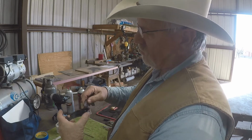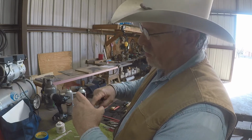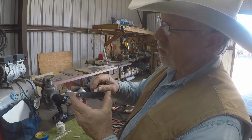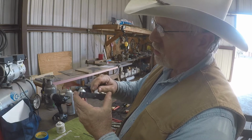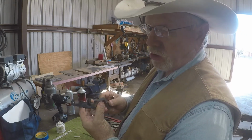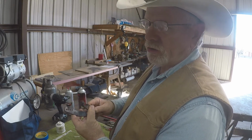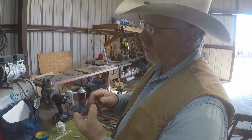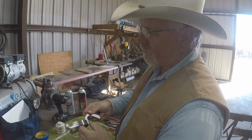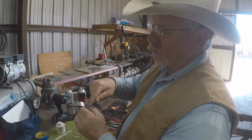And I'm going to put this with the pin in it onto the band, and I'm going to brad it right here. I've got that countersink where I can brad it. And then that's got the shank on the band. Then I'll proceed to weld around it all the way, and then I'll have to do some filing to knock the bead back flush with a definite line.